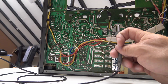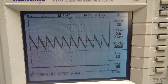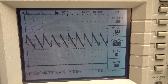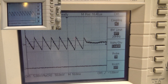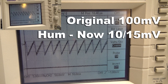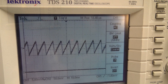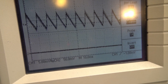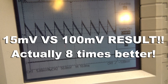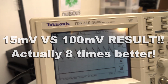This is quite encouraging — checking the power supply, this is the positive side and we've actually halved the amount of noise on the positive side. On the negative side we're again about half the amount of noise. So the power supply is definitely looking better. Down in the bottom left of the scope display you can see we're on 5 millivolts per division and we've got about 10 millivolts — about half the noise compared to before.